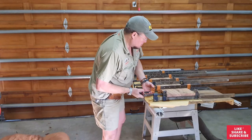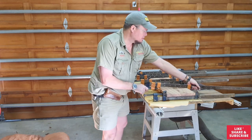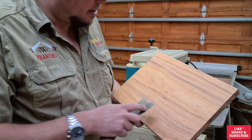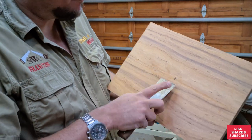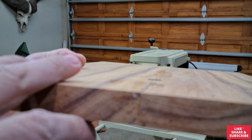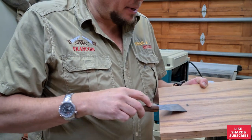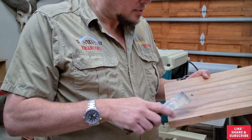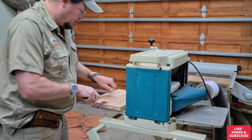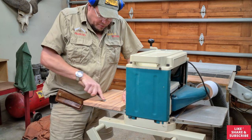It's the next day, about 15 to 18 hours later. The glue is dry so we can remove all the clamps. All the lumber is out of the clamps now. You'll see where the clamps ran there's a little bit of glue that dried on the surface. This will have a significant impact on the height when you put it through the planer. So it's important to look for any glue that dried and remove them before you put the board through the planer.